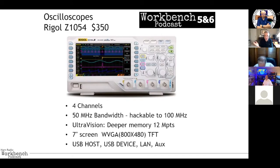If it does, it looks like noise to me. So I need to put a scope on that pin, hit the button, watch the data come out of the computer, and I can see, oh, I did see some data coming out. So at least I know the data is coming out of the PC.